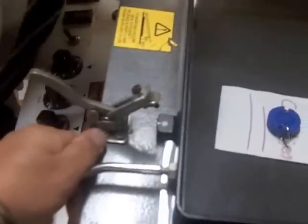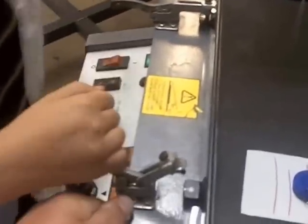Right, then what? Then you need to put your card in. Put it in so that goes on the bed. And then you need to put your torch in. Put your torch on your blister pack design. And then you need to get the plastic. That is clear PVC. You're going to get a sheet of clear PVC and put that on top. Hold on, make sure it's right up and covered over the rubber seals, and that it's not getting in the way of that bit there. Then you pull the clamp down. Press it really hard down here so you can put the toggle clamps down. One toggle clamp. Good, you got it. There you go — two closed clamps.